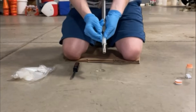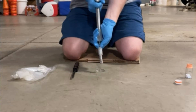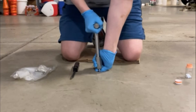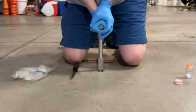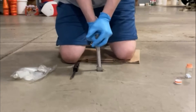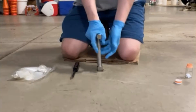Place the bottom of the assembly into the 5/8-inch diameter hole in the slab and engage the silicone sleeve with the concrete. Once you feel the VaporPen sleeve catch, push down on the IE tool with both hands, using your bodyweight while keeping a steady balance. Keep pushing until you notice that the coupling hits the concrete, then unthread the IE tool from the handle.